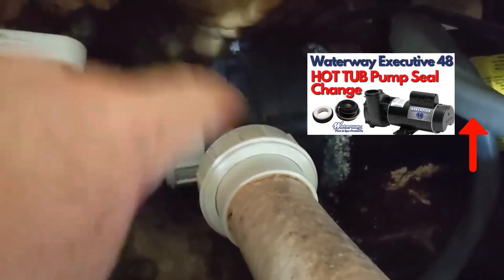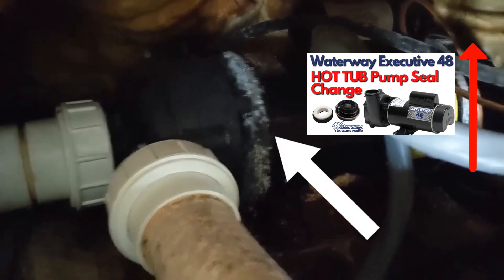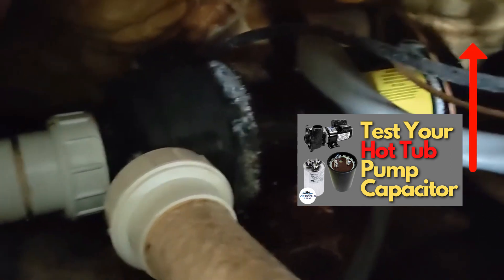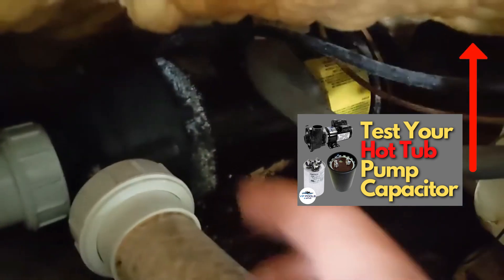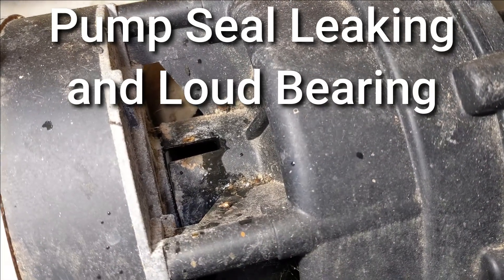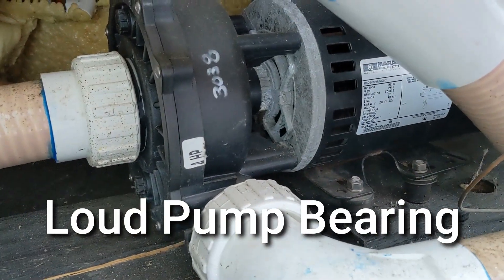We found pump one, and you can see all the crusty stuff — the seal failed and sprayed back into the motor. It looks like it's been like that for a long time. Normally you might be able to save it if it was tripping the breaker due to a capacitor, but I can almost guarantee it's the windings, so you have to replace this pump. This has gone way past the point where you can salvage it. This is why, especially when your seal fails, it'll spray back on the bearing and the bearing will be loud — it's gone past that point.